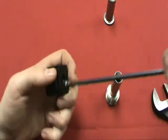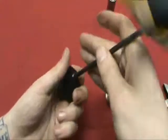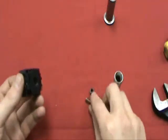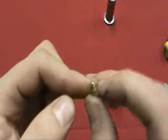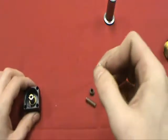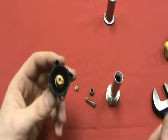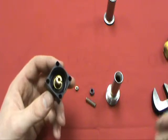Behind here in the back you'll notice the relief valve. We put a relief valve in the guns to regulate the airflow in the air chamber, so if your pressure exceeds what you want to shoot at it will bleed off. That's done with just a set screw, a spring, and a little valve that comes off — it's got a little round top and a little clear o-ring. You might want to take it off just to put a little oil on it from time to time. Inside there there's a brass housing threaded in with a black o-ring; I don't take that off — there's nothing that can get in there and no reason for it to leak.